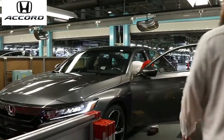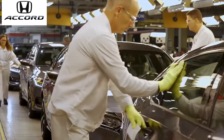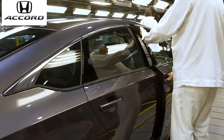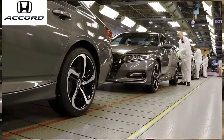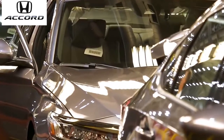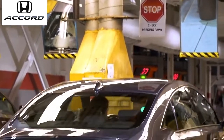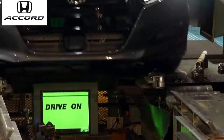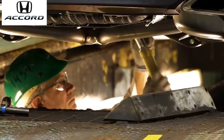That sets up the radars and the cameras in our car for the new technology cars that Honda put out this model year. Next, after the car leaves the mass station, it'll go down through our exterior and lock function check. They're checking gaps on doors, they're checking closing force of your trunks, your bonnets, your closing force of your doors, your child locks, your seat belt, safety latches. After the car goes from there, the car will go into our dyno area. Our dyno will set the front and rear alignment for the car.